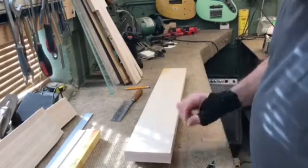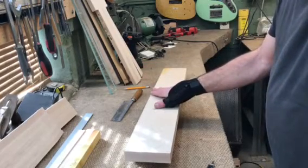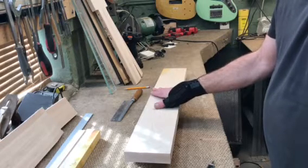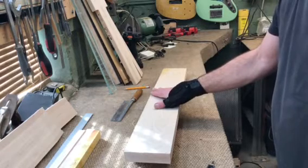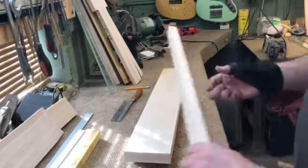So I take a flat sawn piece. When you're working with these things, in the beginning I'm going to just use the wood as it is. Most of the time you'll find out later on that when you do work, it's better to take the wood to the proper dimension beforehand. Otherwise you wind up with all kinds of extra work at the end. Like you could shape the neck, but you wind up with extra meat you don't want to deal with, and then sometimes the scarf joint will move.